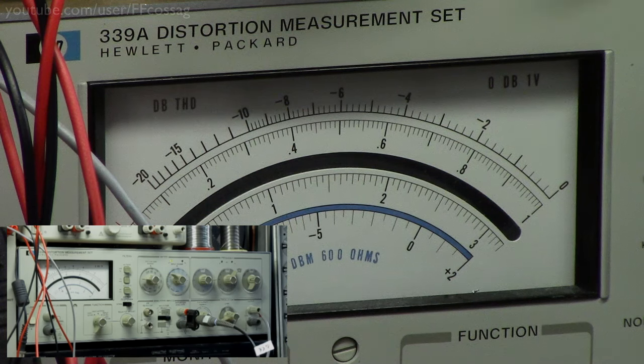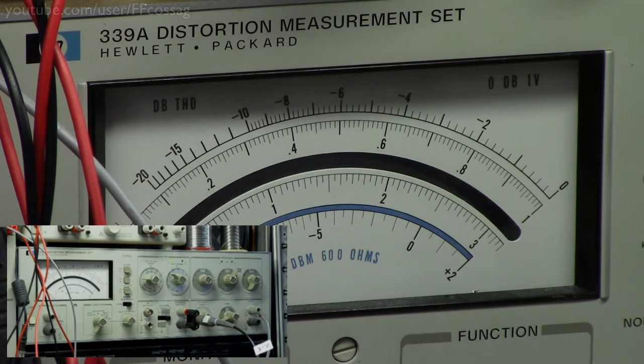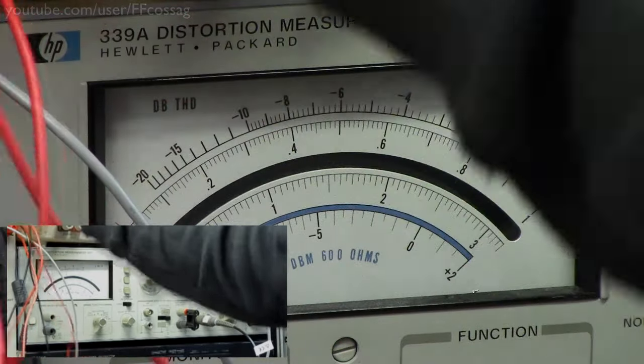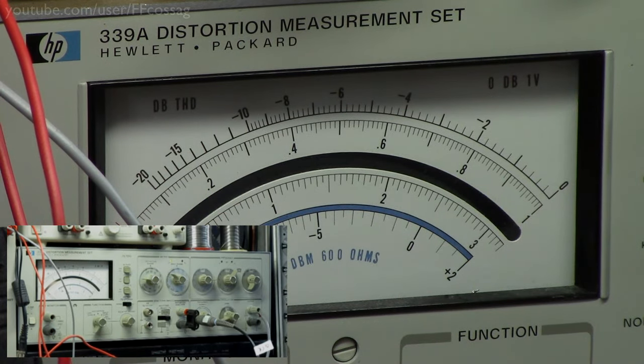I'm kind of torn whether or not I want them to have a high pass filter. It would be nice to have two full range channels plus one extra subwoofer channel and just let the natural roll-off of the speakers do the high passing for you, but on the other hand, that would possibly give you some issues with overdriving your stereo speakers, since you might be giving them just as much bass as you're giving the subwoofer. But we'll find out. So we're connected up to one of the front channels now, gonna remove the extra load and get to 8 ohms. So let's just turn it up and see what happens.